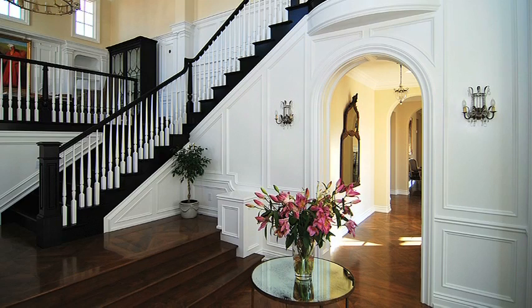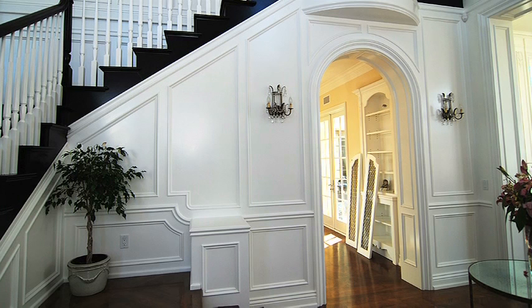That is so cool. You guys used this. Yeah, you sent me these pictures. This is a job that the two of you did. So you used that same joint right here in this living room. It's a little hard to tell, but there's a better picture here, on this up-easing on the chair rail, where the curved joins the straight, where it joins a level. You have to have the same miter.